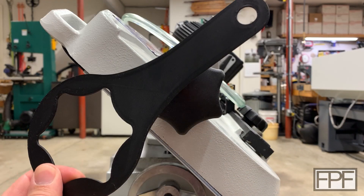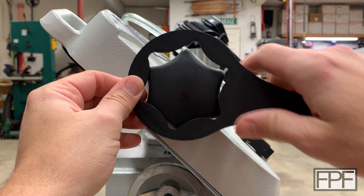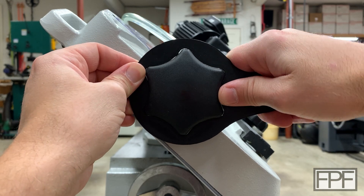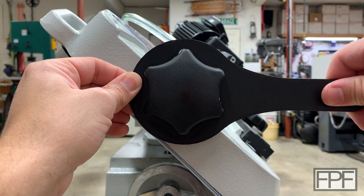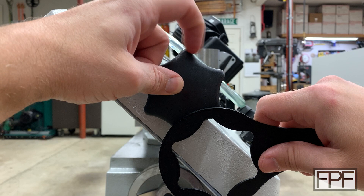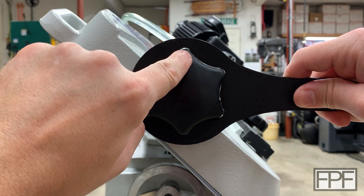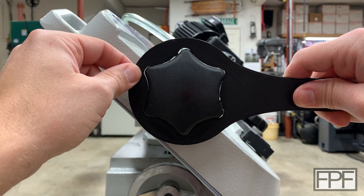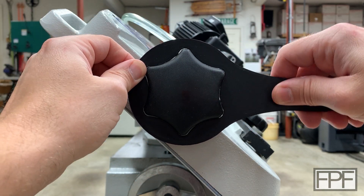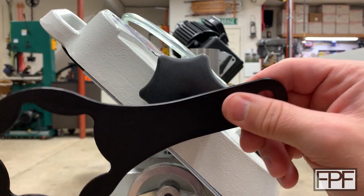Here is our updated print — I also added a little bit of a handle to get a feel for how much leverage we're going to need. And you know what? That is still loose. I tightened it up but I didn't tighten it enough because I don't want that much play in it. The looser this is, the more chance we risk rounding over part of these corners. It's contacting all the way up towards the tips — I'd like contact further down. I think our overall diameter at these tips is still just a little bit big; I'm going to take maybe 0.5 to 0.7 millimeters off and see how it fits.